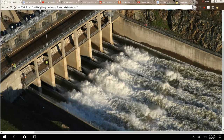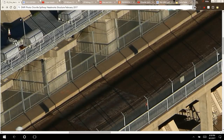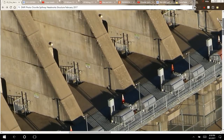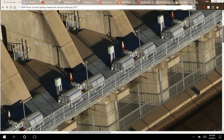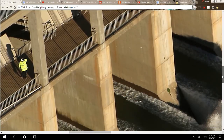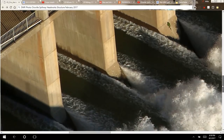The gates are hoisted using electric motors. I'm not sure how much the gates weigh exactly, but just downstream at the diversion dam their gates are a little shorter but wider and they weigh 24 tons each. Above those gates is various decks — there's a hoist deck and a trunnion deck, which I'll talk about later.